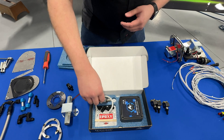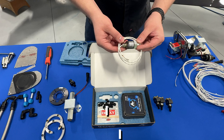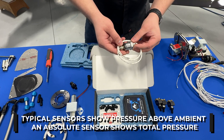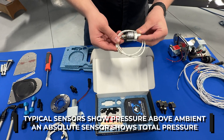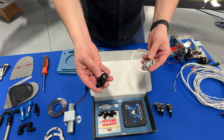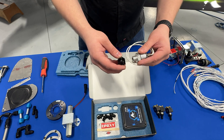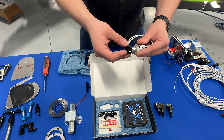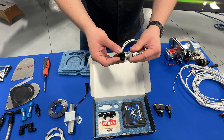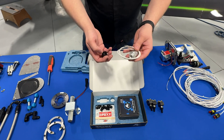Pulling the next couple layers off further inside the box, this here is an absolute pressure sensor. This allows you to see the absolute fuel pressure of the feed side of the Rotax pumps. We're going to have a new sensor version that threads direct. By being able to read the absolute pressure, we'll be able to determine if you're in a danger zone for fuel vaporization.